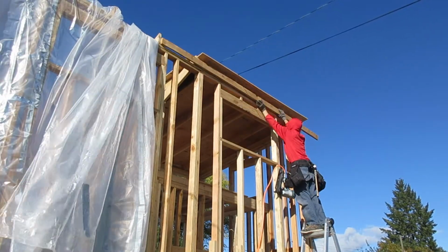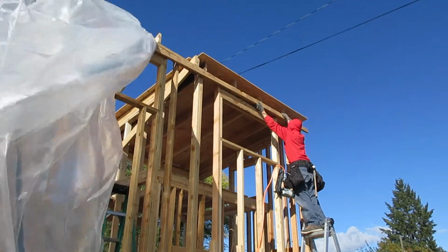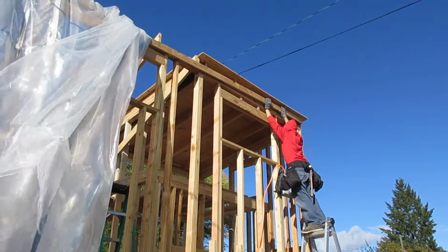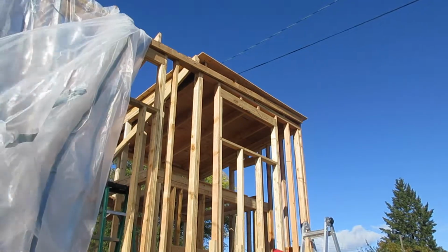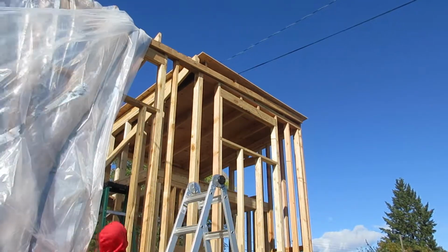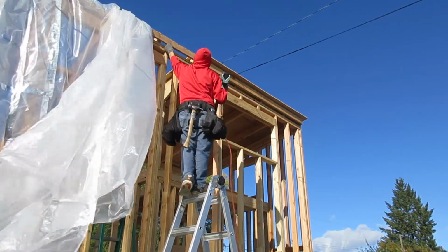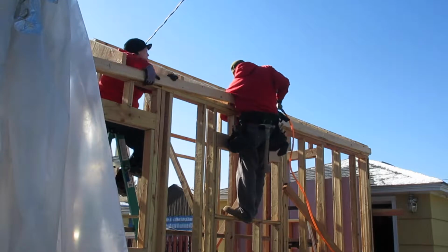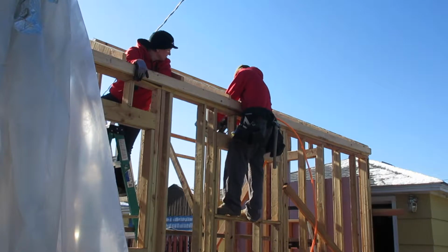He did some quick finishing, fascia, subfascia. Yeah, I really should have had scaffolding for this. It would have been easier to walk back and forth. But right now, I'm just doing it from my extension ladder. So now I have to move it and then move over a couple feet and nail it from the other side. And it's just a short bit. I didn't have a whole lot to do, so I'm fine just doing that. I'll get some scaffolding or something when we go to put on the sheathing for that side of the house.